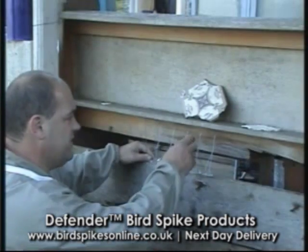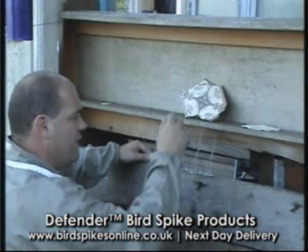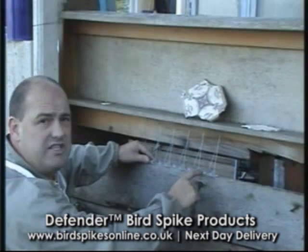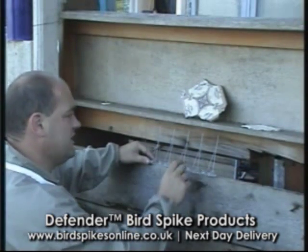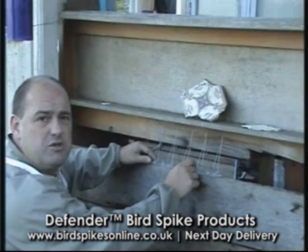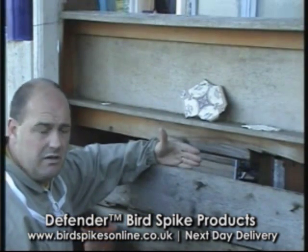Pigeons can actually force their way, because if their nest is behind there, they may be able to scrabble and force their way past the spikes into the cavity behind. Of course, because the spikes are there on that ledge, they won't be able to use that ledge anymore. But please, it's important to notice that the spikes will not stop the pigeons getting into a cavity behind. What you need to do there, before you spike the ledge, is to block this cavity with some mesh.